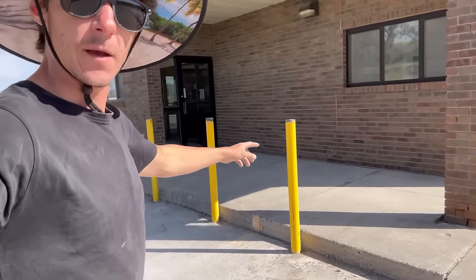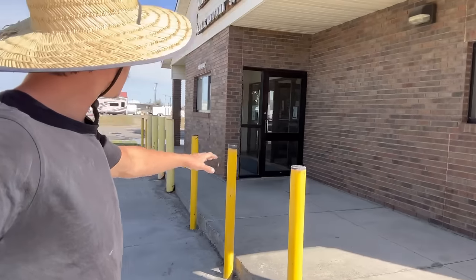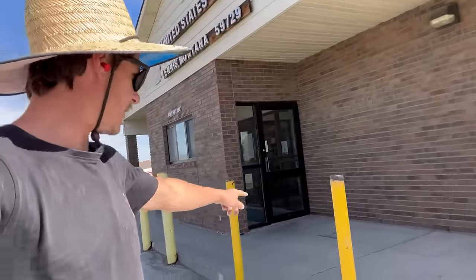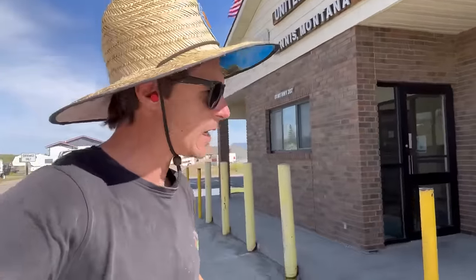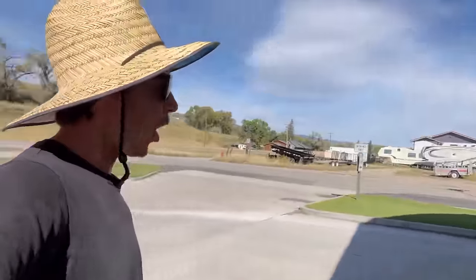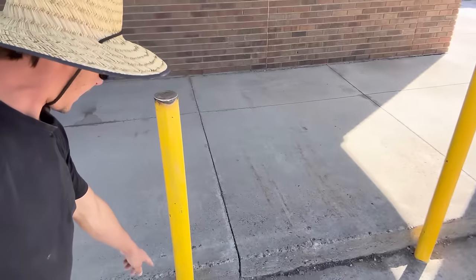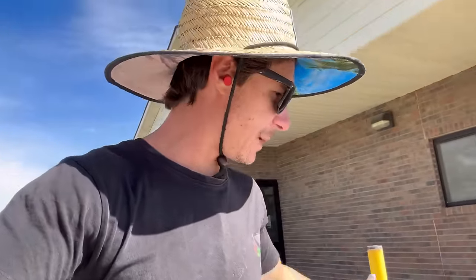What's up YouTube, it's Melt Metal Anthony. Today we're installing bollards. I've already got a bunch of these installed — the little ones are the three-inch, I think they're four-inch OD with a schedule 40 wall. They're pre-filled with concrete and we've been pouring out and setting these things in. We get two inches on each side, we're digging down about 24 inches, and then spacing them out and putting them in the ground.